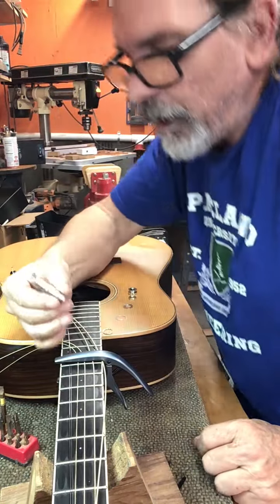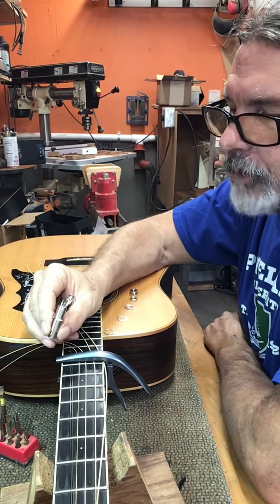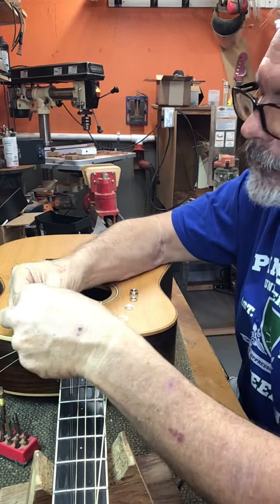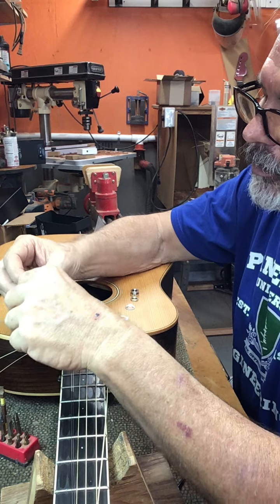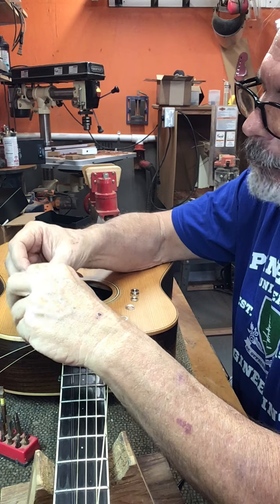Now, these plugs or input jacks are a bear to solder. The smallest lug on that jack is the one that's got to take the hot lead. Once we have the hot lead done, the shielding or ground wire is simple.